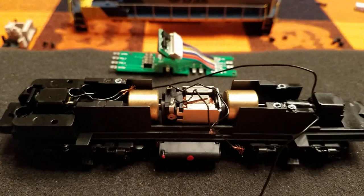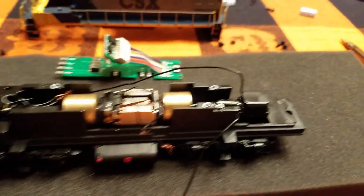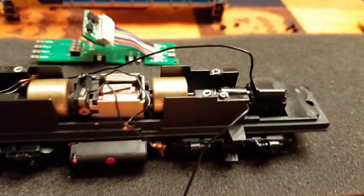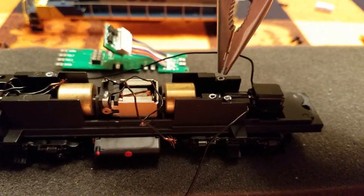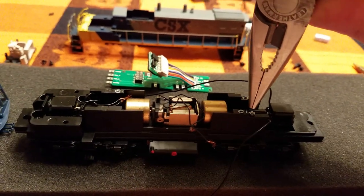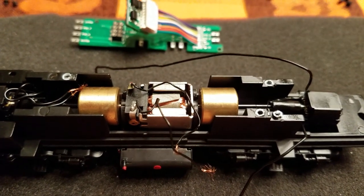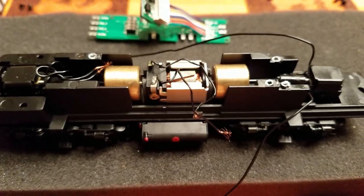And then the next step I did is there's four of these little metal weight embosses, because it did have this in the front. That's not on the sound unit, so it's not going to be on this one. So that was removed. The two screws that go in there, basically these were embosses sticking straight up, and I grabbed on as hard as I could and just kind of bend it one way or the other, and it worked really good, except for this one. I'm going to have to sand and file. Before I do that, I'm gonna mask off all the moving components so nothing gets down in there.